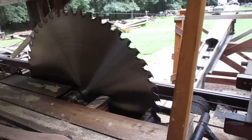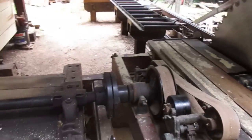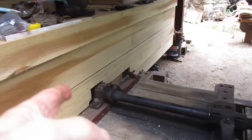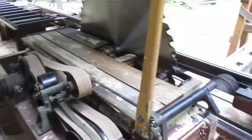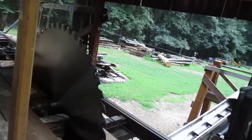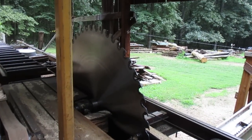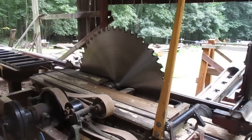Here I'm close enough that I can just look over and see it. So I'm all right with this one. But when I get back on that other mandrel on the number one, which has to have the lead checked, I can't see from back there to see if that micrometer's moving off the zero. So that's how I adjust the lead. I'm going to set this one at 1/16 of an inch, see how it does.